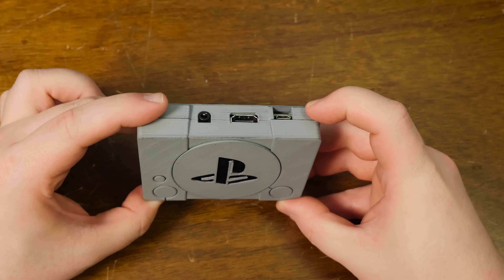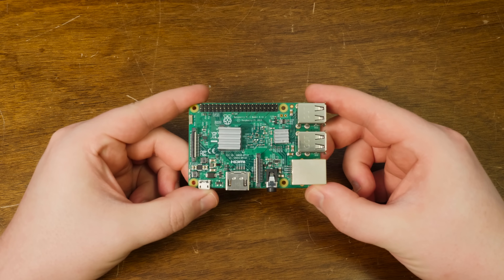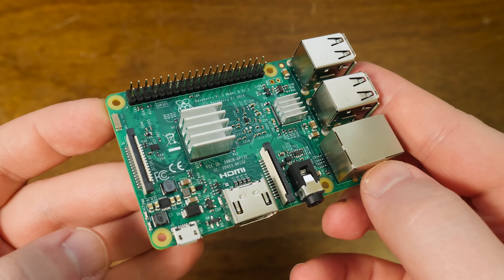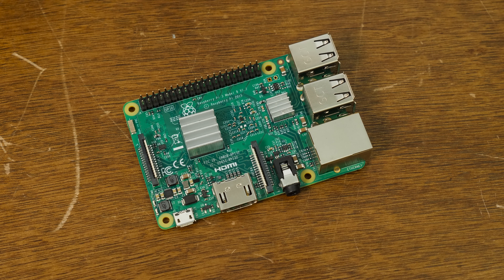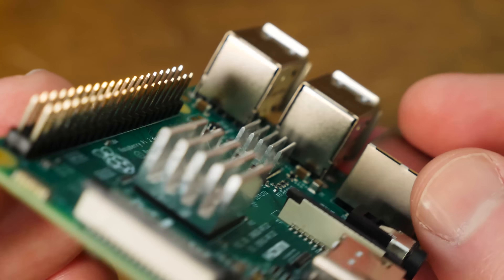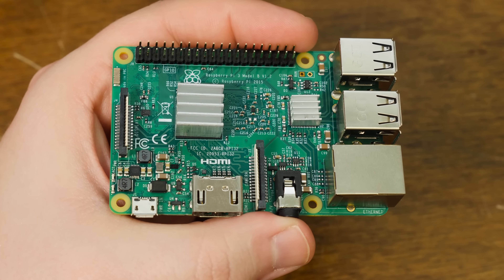It's a Raspberry Pi 3 Model B in a 3D printed case running the RetroPie front end, and that's it. Nothing fancy or exotic, and I'm well aware this kind of solution is not news to many of you. But for those of you that have never done so before or are simply curious what parts I chose, the rest of this video is for you. The first item is of course a Raspberry Pi, which is really just a tiny system on a chip with some handy integrated interfaces. I went with a Raspberry Pi 3 Model B — it's more than capable of running PS1 games and only costs 35 bucks. However, it tends to have some challenges with heat distribution, especially inside a case, so I added two straight fin aluminum heatsinks from Love R Pi for $1.99. They come with thermal transfer adhesive and drop temperatures by a good 25% according to my own testing. Do not skip the heatsinks if you're planning on running PS1 games, as I ran into a bunch of performance throttling without them installed.